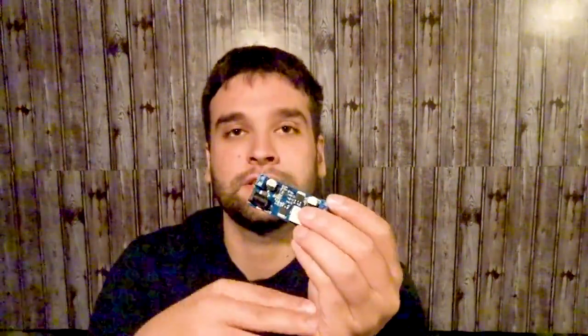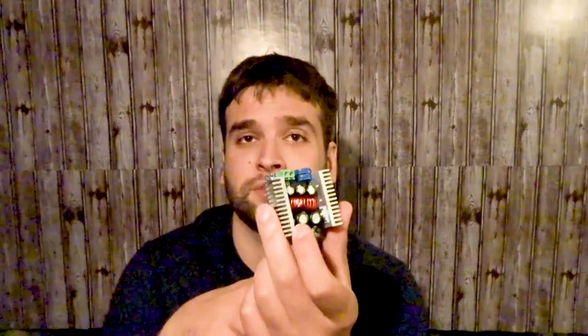When you're doing this on and off with a computer like the Jetson Nano or Raspberry Pi, you have a very high risk of damaging your SD card and damaging the OS, and the code you worked so hard on is essentially going to get lost if the SD card loses all that memory. It is not worth it when you can get buck converters that are more specific to the amperage — this converter is really not reliable enough to be using it with those computers.